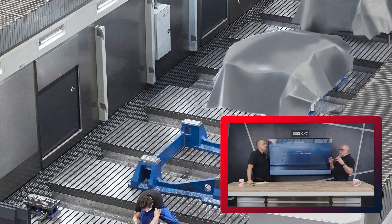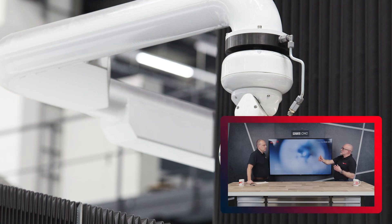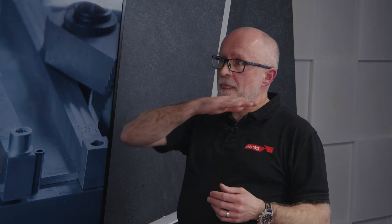We have to enable the tool to repeat. So if you send a machine to a position and back again, it has to go to exactly the same place. As long as your machine is rigid and reliable with its positioning, you can then track any inaccuracies — and all machines have some inaccuracies. So we have a very advanced mechanical system, and then we sit a level on top of that when required, where we can actually map the volumetrics of the machine envelope and compensate any inaccuracies. So when we do a tool change, we've got control of the thermal behaviour of the machine, the mechanical behaviour of the machine, how it's behaving in that whole environment. When we do that, we get literally perfect blends across the surfaces — you can hold them up and see your face, they look that good.